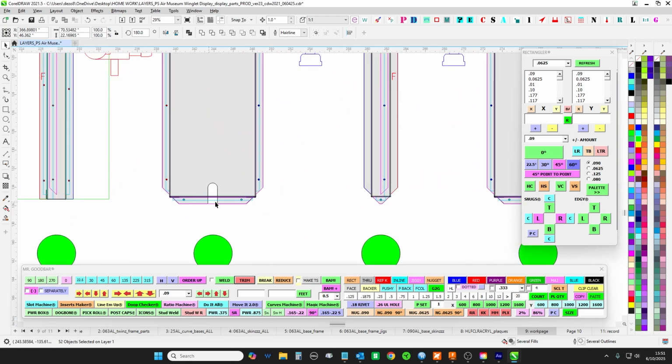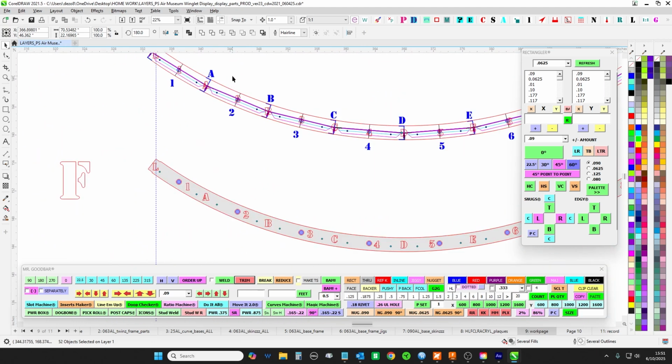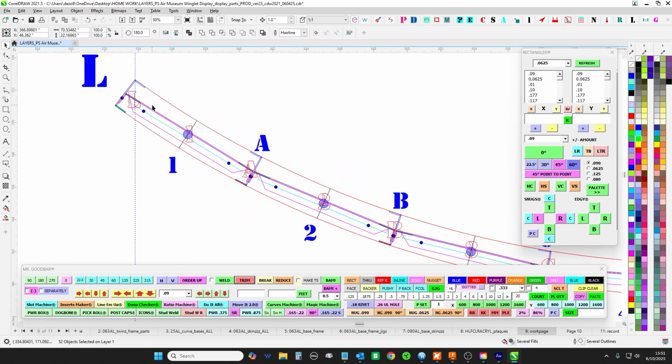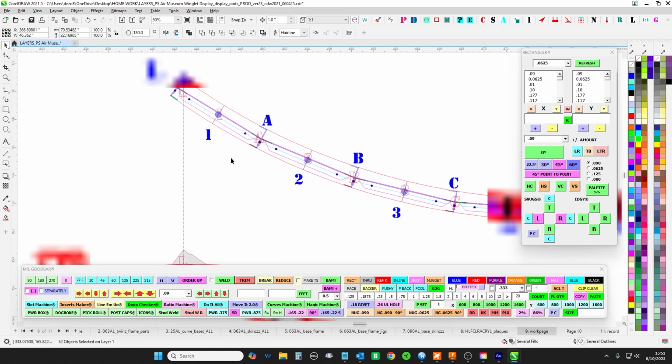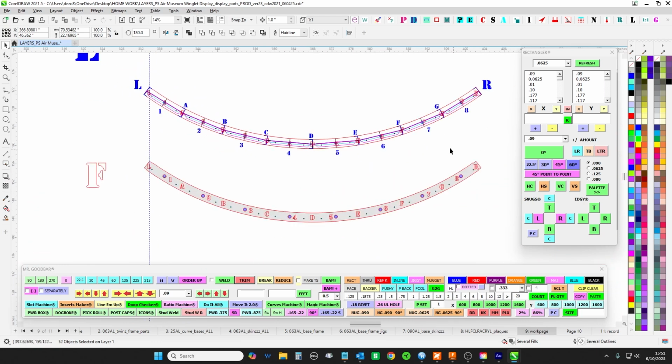Then you're going to tack the 1/4 inch to the flanges, but I would be careful that you want to evenly tack things. We don't need to get too crazy, but if you burn on this side, then maybe burn on this side too. So if you put a tack and a tack, make sure you put a tack and a tack. Just so that way it balances it, because we don't want to put all the heat on one side and maybe make it do something weird or whatever.